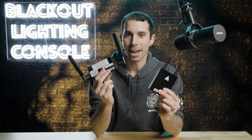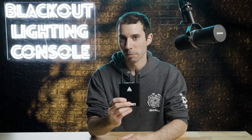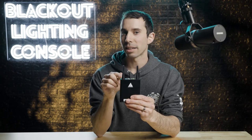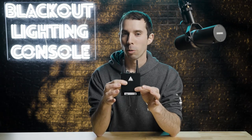So that's the main difference between the Art7 and the AKS. Now, if you pay close attention to the radio pins and the pairing, what you may have missed is that the radio pin you set for this box in the iPad or tablet is independent of the box — it lives in the tube itself, and allows the app to see it when you have that radio pin selected in the top right sidebar. Because it's independent of the box, you could actually swap boxes, connect up to it through your tablet, put that same radio pin in, and you would see all of those same lights appear in your app.